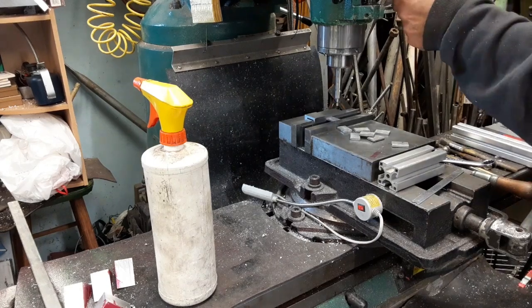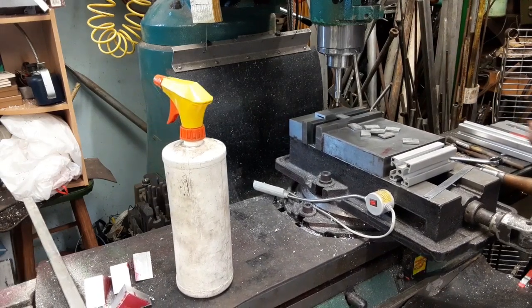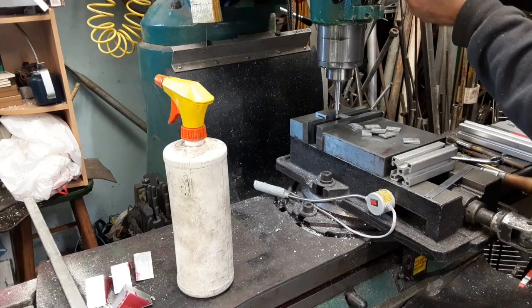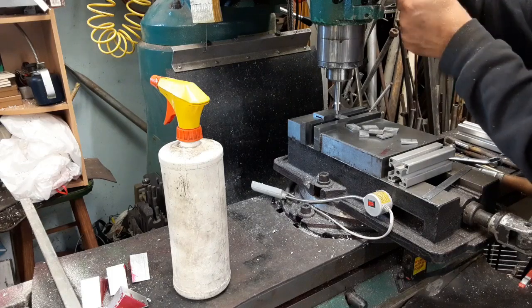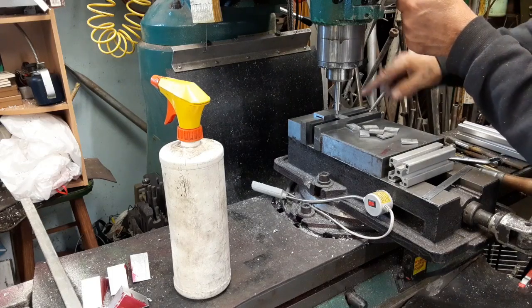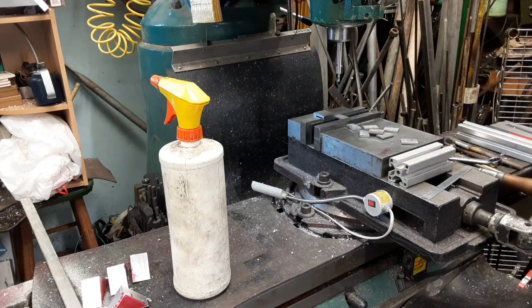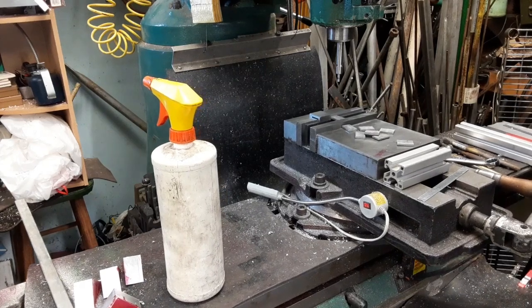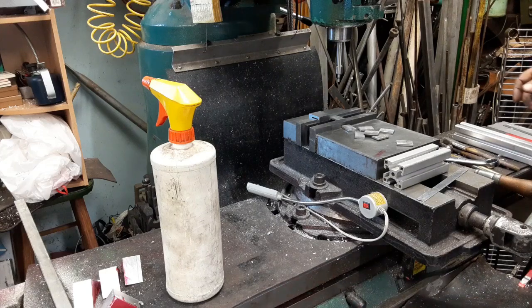Right there. Half — turning to zero. Right there. Lock my Y. Pick up the edge of the part. Right there — zero my X. And then we'll go over the other side, come down, and pick up that edge. There's actually a little bit of radius on that — I want to get down below that. Right there. Go X half, and we are in the center of that part now, hopefully.